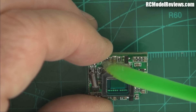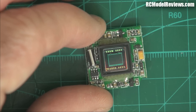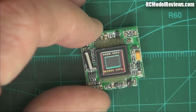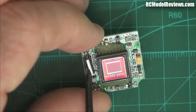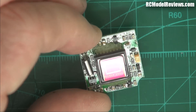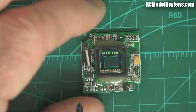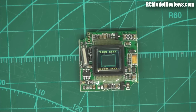If this breaks, you'll never be able to fix it — but if the CCD comes off, it's going to take PCB traces with it and you'd never be able to fix it anyway. So there we go — epoxy on both sides. Now I'm hoping this will still fit in the case when I'm done; I may have to carve a bit away. I'll let that cure while I get the hot glue gun going for the crystal. Why not epoxy for the crystal? It has a silicone-y or rubber covering and epoxy won't stick well to that, but hot glue will — and hot glue has more flexibility, which means it will actually absorb a little bit of vibration or impact associated with normal operation. Epoxy becomes quite hard and rigid so it won't effectively absorb any.